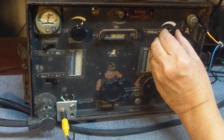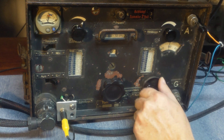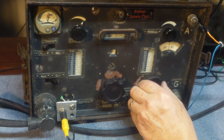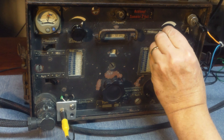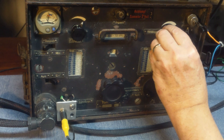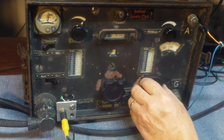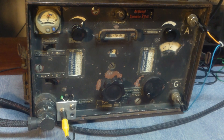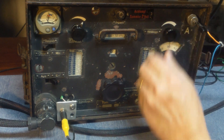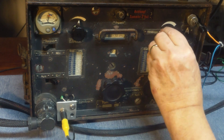It's a little tricky using this being a regenerative receiver. There's no RF gain control and there's no AVC action. So a lot of times you have to play around with the regeneration control. The level and regen control both kind of interact, so it takes a little while to use one of these. There's the 80-meter CHU in Canada. I'm going to go down to the CW subband on 80 meters.